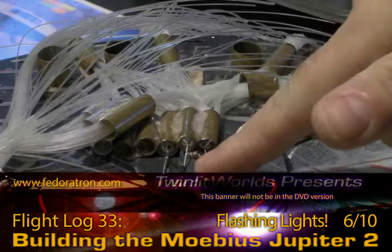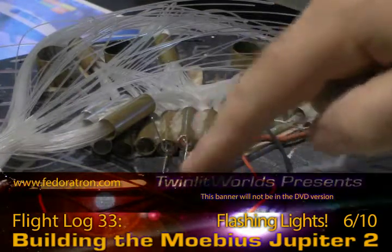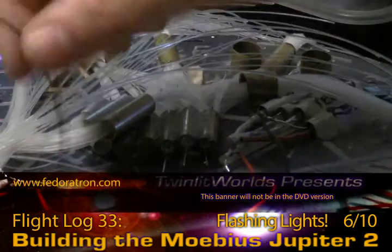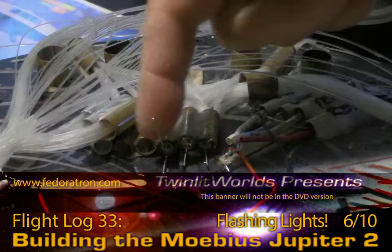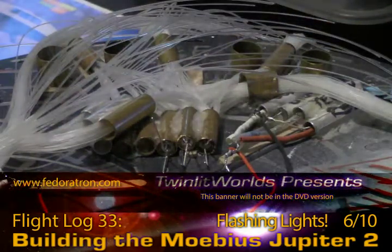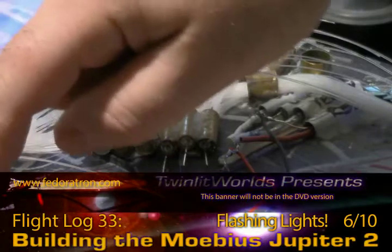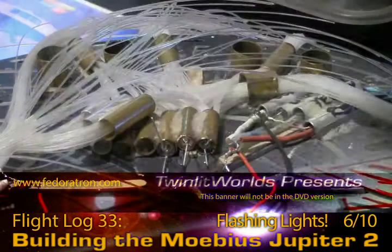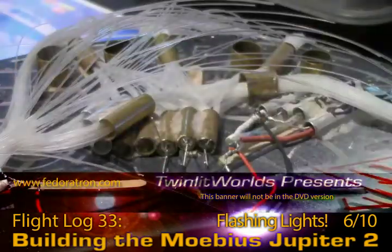Negatives are on the bottom line there. I'm going to attach those as a common carrier to one wire — maybe two, but I imagine you can get away with one. Each of the positives is going to need its own line, and it doesn't matter which of the four those are. The fourth one I'm going to put over on these blues here.